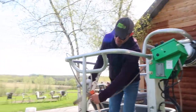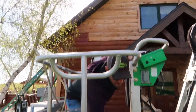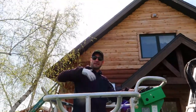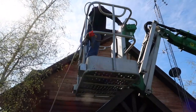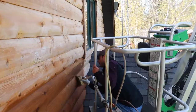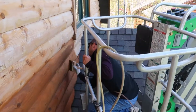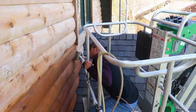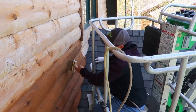We're putting our clamp back on our spray line so we don't fight that. What I like to do is set my stain brush down and let all that stain run out of the bristles as we go up and move. Since I'm just a one-man band to start the morning out here, I'm only taking two logs at a time — not three or four — because when you spray the stain on, you need to make sure that you back-brush it in before it starts to dry.